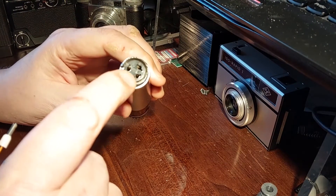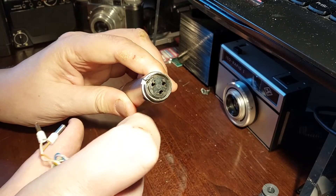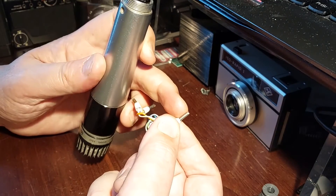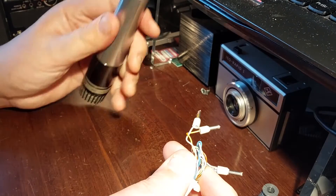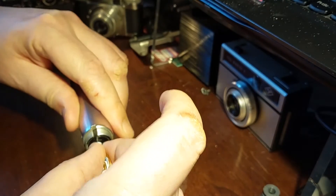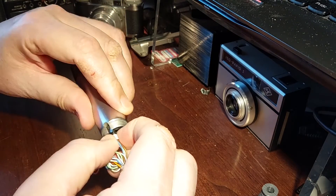The first thing I did was measure the size of the pin and also compare it with the size of the pins on an XLR plug. I found that it's only about 0.1 of a millimeter smaller than this size of crimp-on cable termination. You can buy great kits of crimp-on cable terminations, and I went through mine and found the one that fitted — it just gently presses into the hole, just like you would expect from the pin on an XLR or similar.